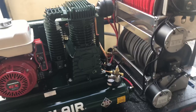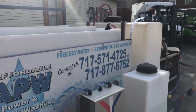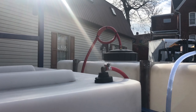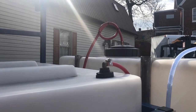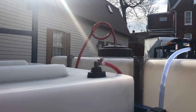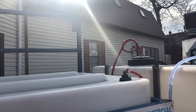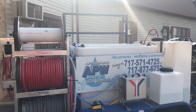We also do some small things whenever we build a trailer just to make things a little bit easier. We have a vent here on our bleach tank — that little circle of hose is just going to be a vent line. Since we're not taking off these tanks to fill up with bleach, we can leave them on all the time. That vent line goes through the bottom of the deck so it just gases off and your tank doesn't expand. Just the little things that we like to add to our builds.